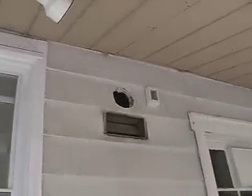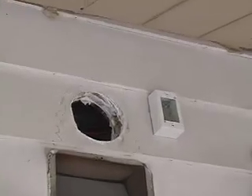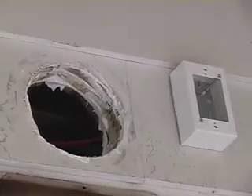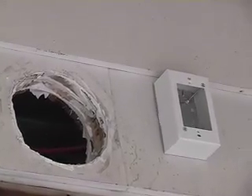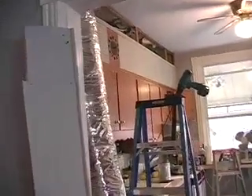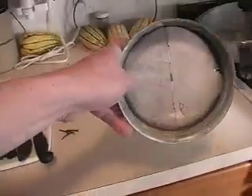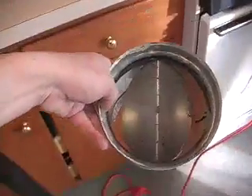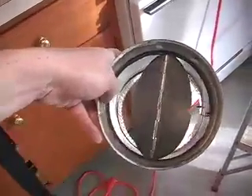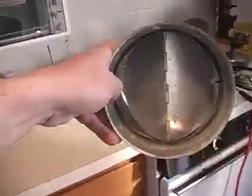This is the secret to turning your porch from a regular conservatory or glassed-in porch into a solar porch. This hole will take air through into your house using a thermostat. Here's the hole in the living room wall and here's the insulated pipe I'm putting above my kitchen cabinets — I'm going to bring the air from the porch into the living room. In line I'm going to put this damper which only opens up when the fan comes on. That stops cold air from coming in through. Now as you can see that's a six inch line I'm putting in so I can get a good lot of air flowing through.